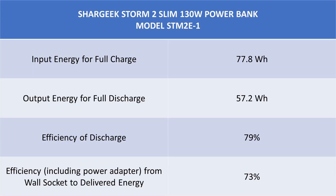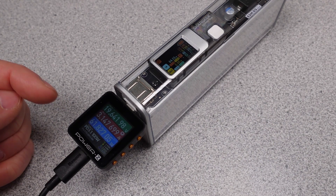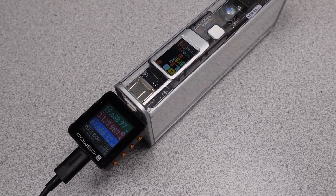We have the battery capacity of 72 rated watt-hours — a high capacity, but not a huge portable power bank. I measured the output capacity at 57 watt-hours. With the losses for converting the voltage to the output, you end up with about 79% of the stored energy being sent to the output. This is okay, not setting the world on fire — but it may set itself on fire. The charging is okay, so the overall system efficiency with a 90% efficient power adapter ends up around 73%, which is about average. Using this power bank wastes 27% of the energy you pay for to charge your device, and that number will be worse with less efficient power adapters.